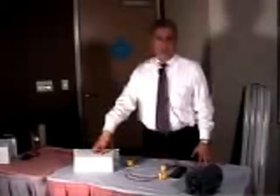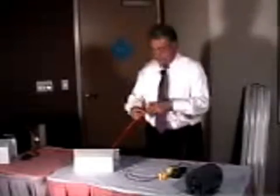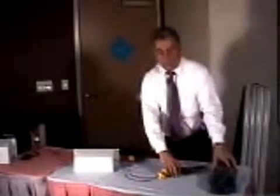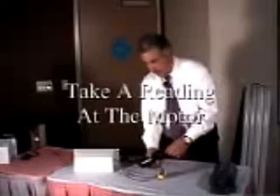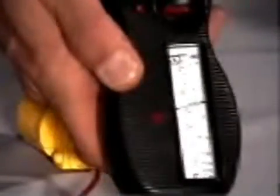I show this as representative of the kinds of things we look for to increase the efficiency of his electrical system. It's passive — it saves electricity and money by increasing the efficiency of something else. I plug the motor into the extension cord and take a reading to see how much electricity it's using — it looks to be about four and a half amps. I don't even refer to that as amperage; to a non-technical client looking at that, it's four and a half dollars.